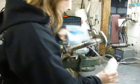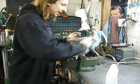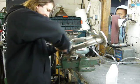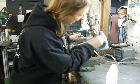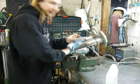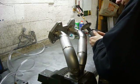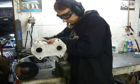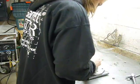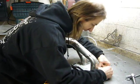The horrible mild steel MIG welds are now gone, so before I clean it off with the wire brush to weld, it gets a wipe down with acetone to remove all the marker marks, the labels that came from the factory on the pipe, any gunk that's accumulated, etc. Well, finally, we can get to welding, but just as soon as I bolt these flanges on first.